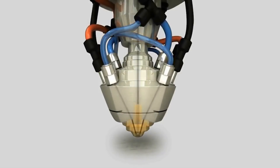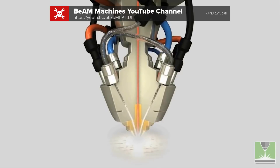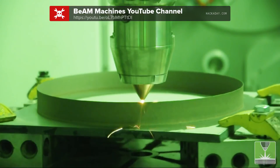There are a few of us who specialize in a new terminology that we call directed energy deposition. Basically all that means is we're taking that and creating a 3D printing process by conveying metallic powder through a nozzle, converging it with a laser beam to melt the powder, and then depositing it using a 5-axis machine tool. A lot of people have hybrid systems where they take a traditional machine tool and mount a laser and a nozzle to it, but we actually design the machines for the process itself.